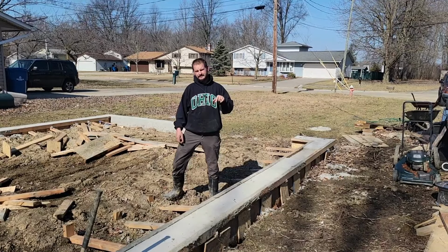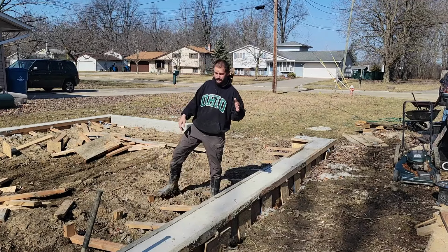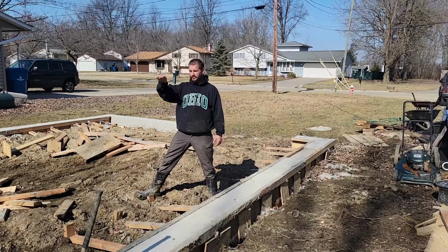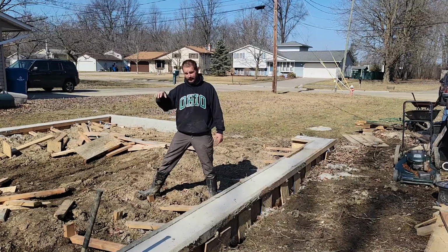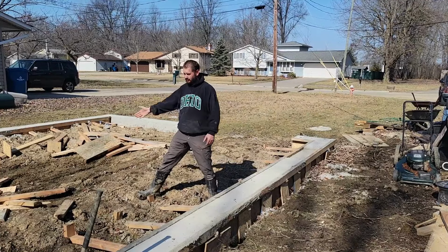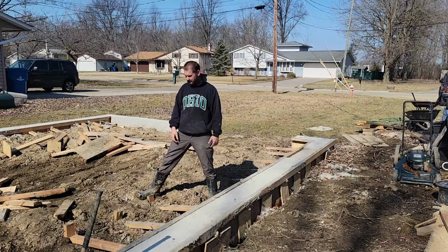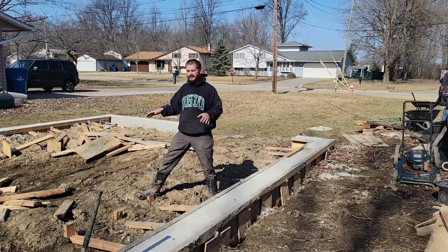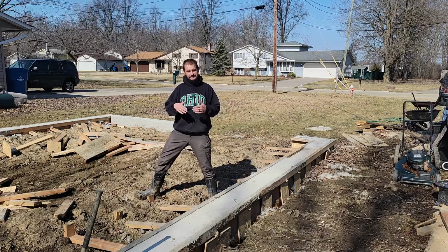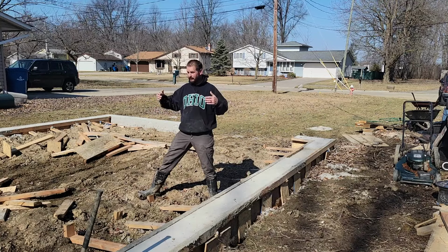I should have about 4 weeks from here to when the building gets put up, hopefully. Hopefully they're going to call for scheduling within a week or so. I'm pretty sure that they can work with what's here. I mean, it's level enough for them to put a building up, but I am going to try, before they get here, to get a skid steer and grade this down, smooth it out, and probably get about 20 ton of gravel brought in here. But if I don't get that far, I don't think that's a big deal for them. I think they can still work with it as is. I would just like to have it as smooth and as nice for them as possible, because the smoother and nicer it is, the easier it is going to be for them to get my building up.